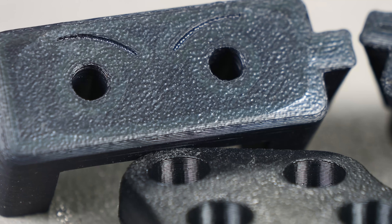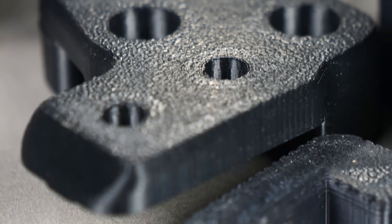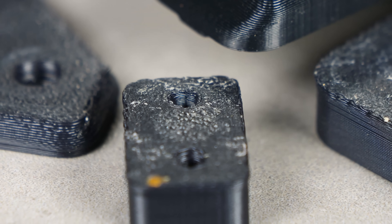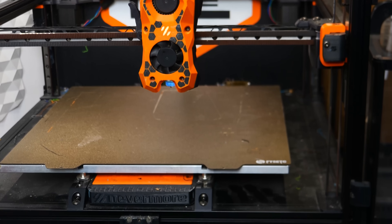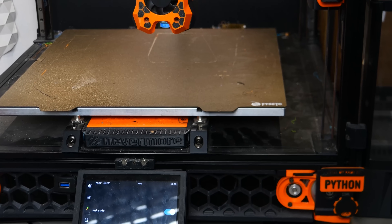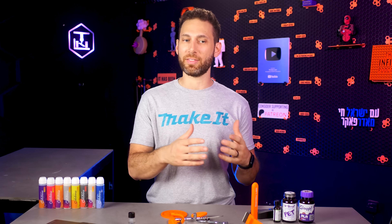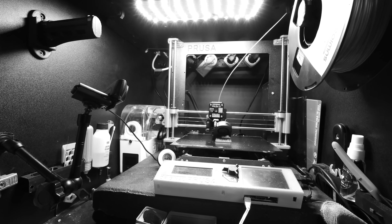Beyond that, it's messy and it lays on thicker than that creepy guy at the bar. This also means that besides making your prints come off the build plate as a sticky, disgusting mess, glue stick will also leave permanent scars on your build plate surfaces. I'm personally reminded of this every time I look at my Voron 2.4, because I liberally used both glue stick and hairspray to get ASA to stick to the bed of my Prusa when I was printing the parts.